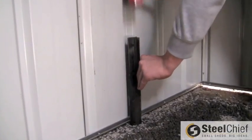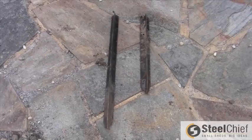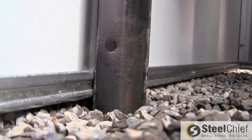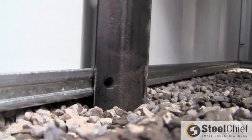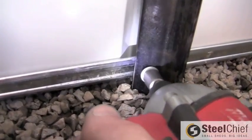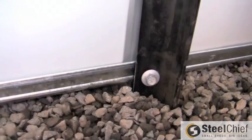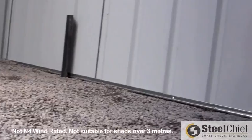In wind protected areas, anchoring may be achieved using star pickets, 450mm or 600mm long. If your shed is on the ground, align star pickets flush against the walls and hammer them into the ground until they are firm and a hole is aligned with the BaseSmart. Usually the picket is fully driven into the ground, showing only the last hole in the post — this ensures maximum grip. Screw into the hole and through the BaseSmart.